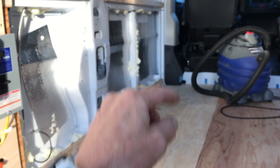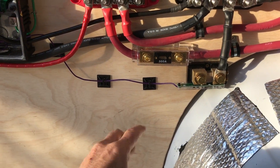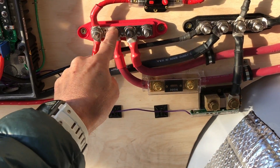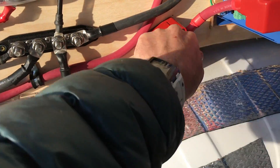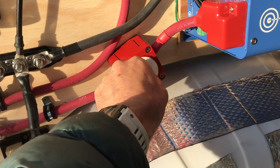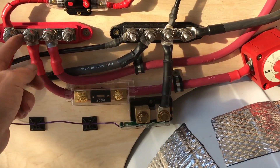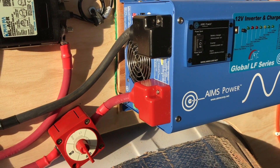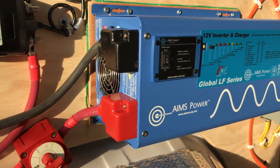The batteries are here and are passing power through this lug to the inverter. It goes through a 300 amp fuse first and then through a Blue Sea switch. I like being able to control that — you could take out the switch or the fuse, but it's a pain. I'd like to be able to control this so if I want to work on it there's no power coming from the batteries. Inverters do draw power even if you're not using anything — just being energized is going to drain your batteries.